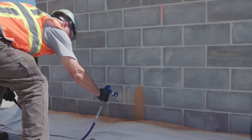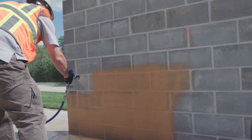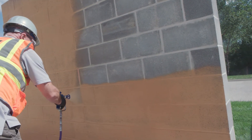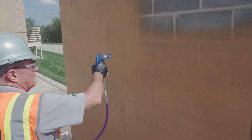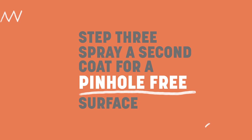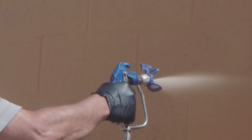Our pump specs call for a 523 tip, whether you use the Titan or the Graco. Greg is going to start with a light horizontal pattern, a little further away from the wall, to put that first coat on and allow it to cure quickly and shrink the pores of the substrate. Notice that Greg is applying material in a wet-on-wet application — coming across with one pass, and then the second pass overlaps the last pass and some new substrate, continually wet on wet as you move across and back in the cross-hatch pattern. After that, he's going to come over it in a cross-hatching vertical application, a little closer to the wall and a little heavier, to provide a smooth and pinhole-free surface.